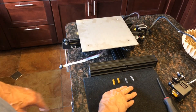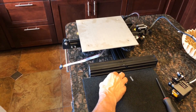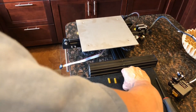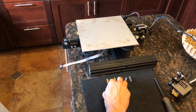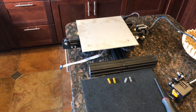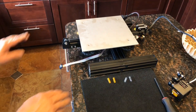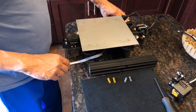The first thing I did — you can see right here — are yellow compression springs. The original springs don't have as many coils and they're not flat, so there's a lot more give to them. These are a lot more solid. These came on a CR-10S initially and they don't put them on a lot of the printers anymore, so that was the first thing I'm putting on this. A lot of people will notice when they get a new Ender 3 there's a little bit of play — you can hear that wobbling.